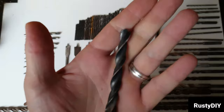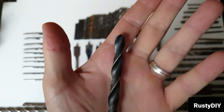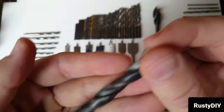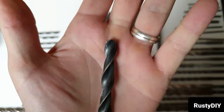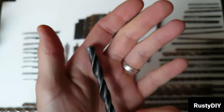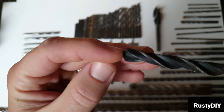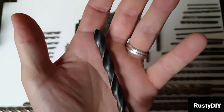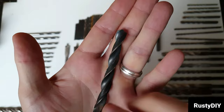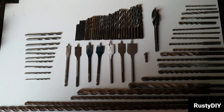The last drill bits to show you are these — you might know these as a basic twist bit or metal bits, but these are HSS metal drill bits. These are really good drill bits because you can use them on a variety of products: lots of different metals, plastics, and woods. You can get different varieties with different types of coatings, but these are just standard HSS bits. They drill the centre of the hole before the outside, so you will get more wood splitting, which is why you wouldn't use these for a hole that's going to be on show — you'd go for your brad point bit. But HSS bits are a great all-round drill bit.